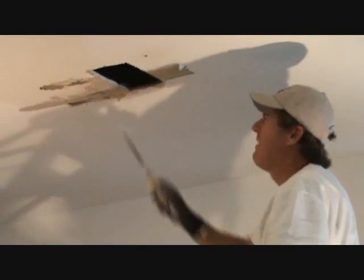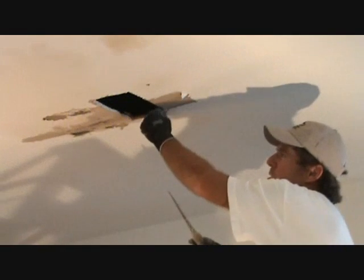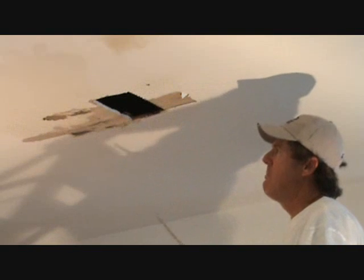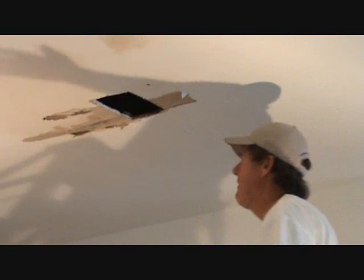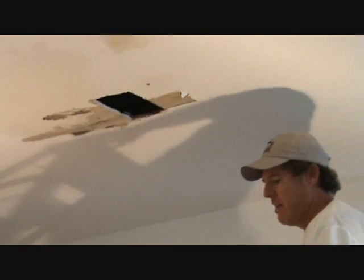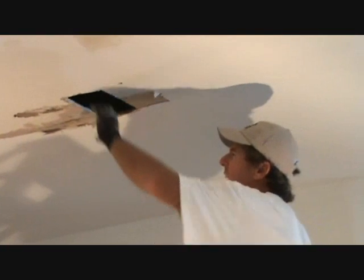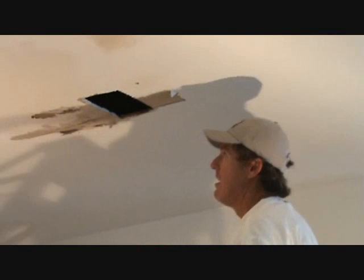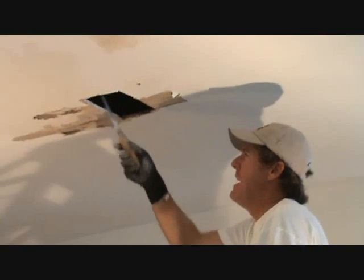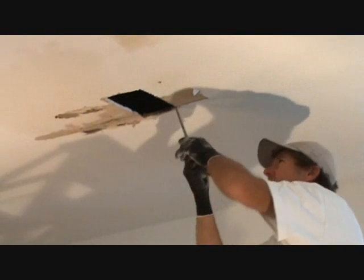Now you don't want to start cutting making the assumption it's half inch or five eighths — nowadays most ceilings are five eighths thick sheetrock. Don't make that assumption, go to the store through all the hassle of getting a four by eight sheet, and then find out you've got the wrong thickness. Before I started, I went over to the crawl space and confirmed the sheetrock was in fact half inch thick. Worst case, you can always cut a patch out, measure your sheetrock, then go to the store.